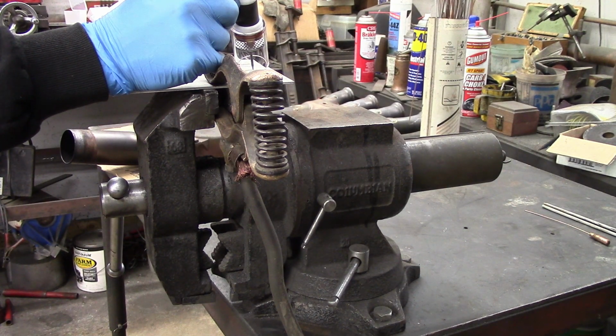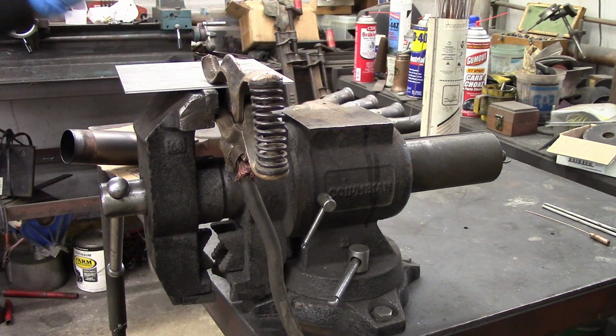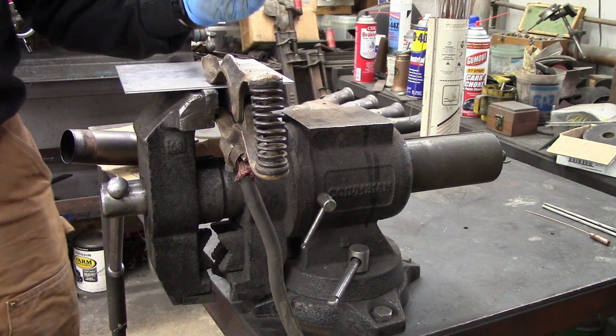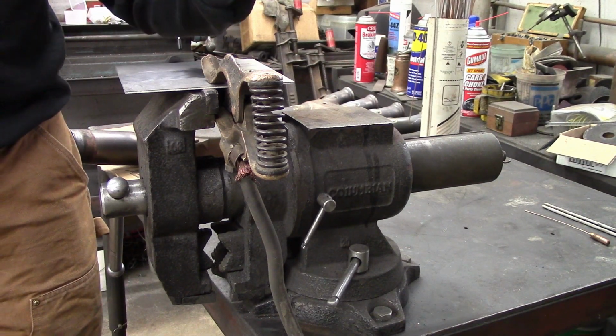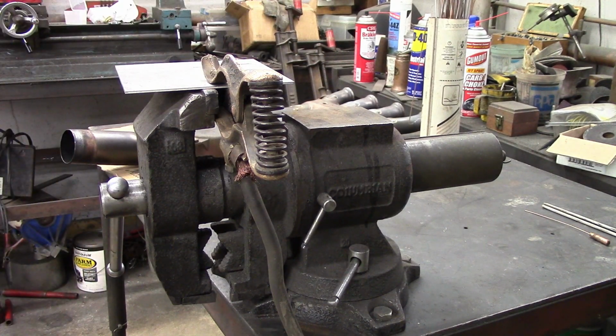So right now it's in the 15-second post flow. And I did a no-no, I pulled this out from under the cup while I was, and let it get contaminated out in the air. So what I'm going to have to do now is I'm going to have to nip the end of this rod off because the end of that rod is contaminated.